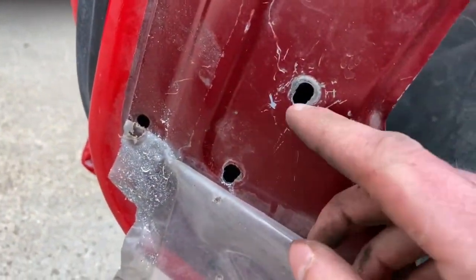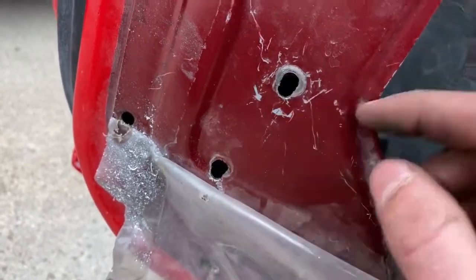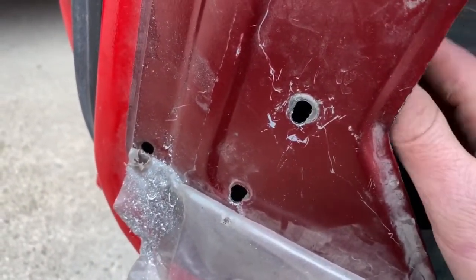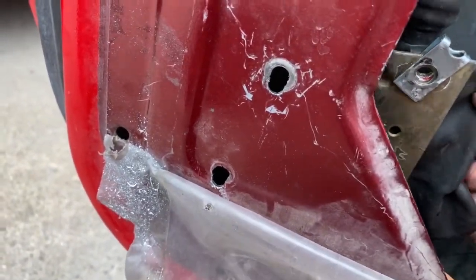The way I've done this is I've just slotted it so that it's adjustable up and down. The way that this moves — if you could see that — is that it moves down and that unlocks it, and then when it moves up it locks it. So if it can't move far enough down, it won't unlock it properly. That's why these have been slotted.